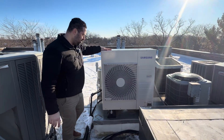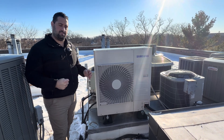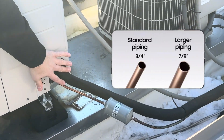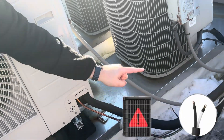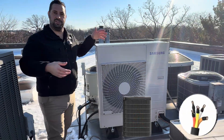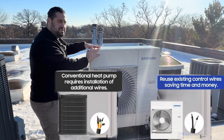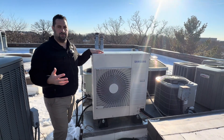So we're on the roof. Here's our Samsung Hilux heat pump. This is a heat pump and air conditioning system that is what is called a universal heat pump. One of the things that make it universal is that this unit can work with existing refrigerant line sets of multiple sizes. The other big thing is that it works with existing communication wiring. Most homes only have two wires, and in a situation like this — an apartment complex — it is not possible to replace the refrigerant lines or the wiring. So a heat pump was a no-go for them until we offered them the Samsung Hilux system. This is an all-electric building, so this system is going to bring substantial energy savings.